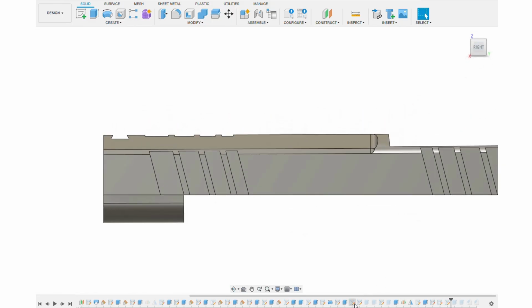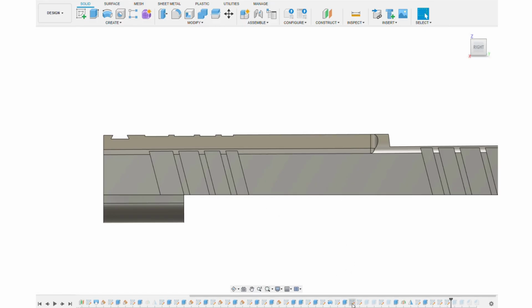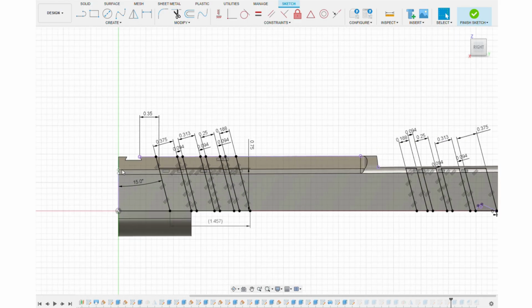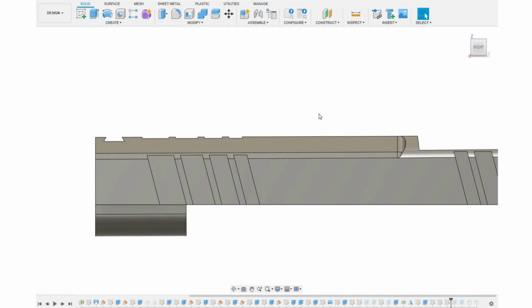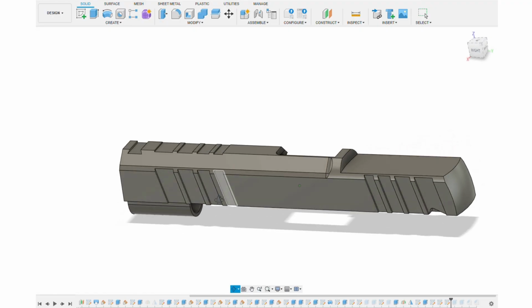What angle are the serrations? Say it with me, everyone. 18 degrees, right? Same as the grip angle of the 1911? No, they're 15 degrees. I think Caspian and Springfield do theirs at 15 degrees. This seems to be rather common, and it's much easier to set up without a swivel vise, which I don't have. Arguably, that 3-degree difference won't be that noticeable anyways.